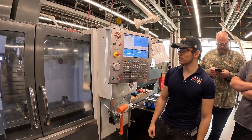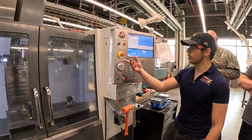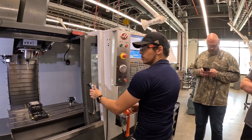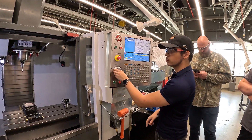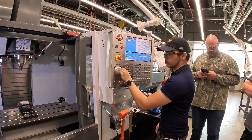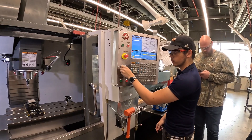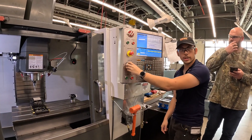One of the perks of these machines is you've got 30 tools and it's going to swap automatically between them. So I got T30 out — this is my probe. It's a five or six millimeter precision ground ruby. What I'm going to do is get it close to what I want to probe, so I'm going to jog it over here.